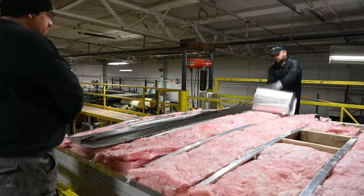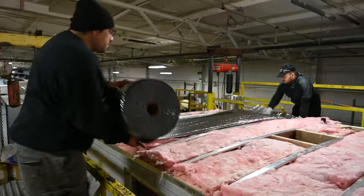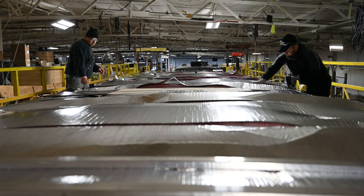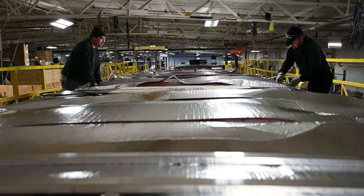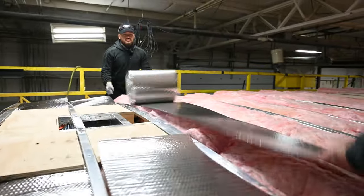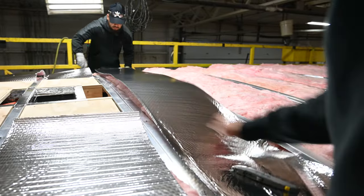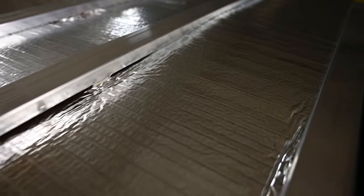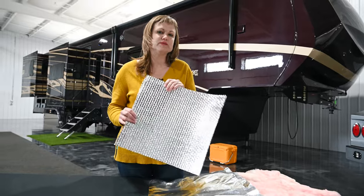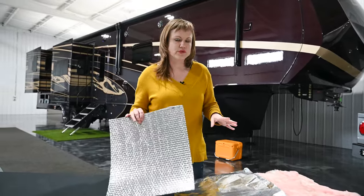The final layer inside the roof is an insulated radiant barrier called Astrofoil. This will act as a shield against the heat of the sun and it has further insulation value when coupled with the dead air space which we will have in between this layer and the marine grade plywood. The bubble layer works as a thermal barrier against conductive heat transfer. I wanted to give you a closer physical example of what I'm talking about when discussing radiant barrier and Astrofoil.